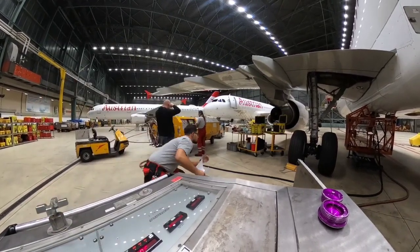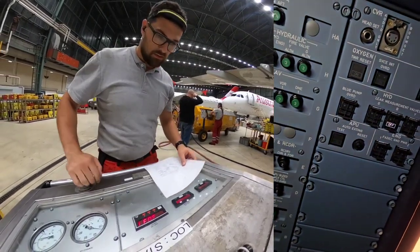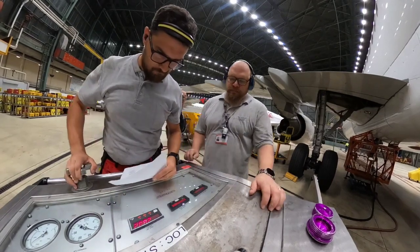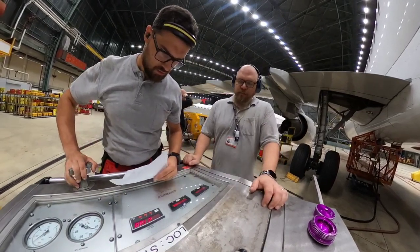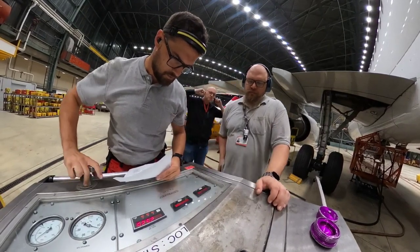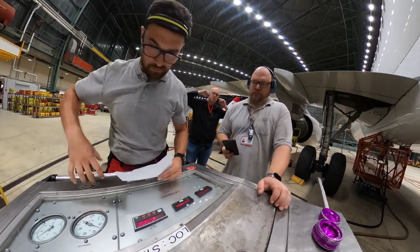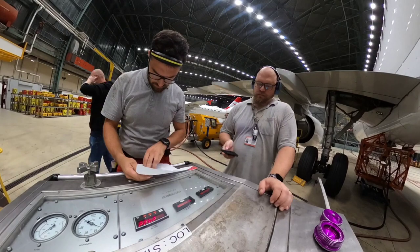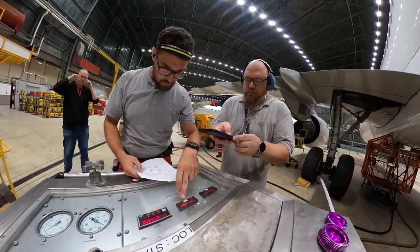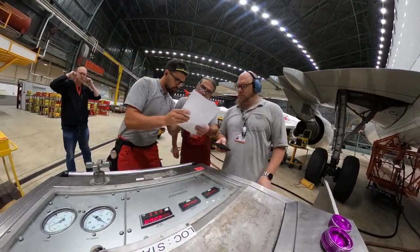When pressure and RPM of the ram air turbine are stabilized, I'll give a signal to my colleague to switch off the blue hydraulic pump, and from now on we'll continue only from the ground. Nominal speed of the ram air turbine is okay, so now I'll adjust the flow to 30 liters per minute. This way I'll create demand in the hydraulic system, and the ram air turbine must be able to handle the load, and it must keep stable pressure and RPM above the limit. And all values are okay, so I'll set the flow control back to 0.